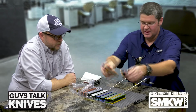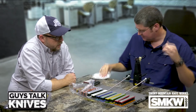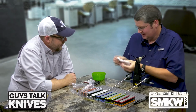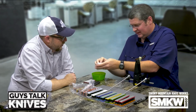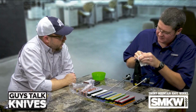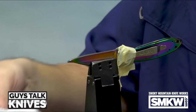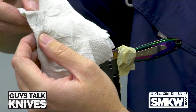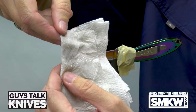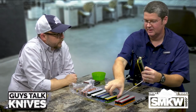And we're good. Now, one thing I'll do, usually, especially once we get down towards the finer end, I'll use high quality H2O. Just a paper towel. Get it a little bit wet. You don't want it super wet. But what you're doing is wiping off the abrasive and the dust. Hold it right up next to the blade, and I can start seeing the metal shavings plus the abrasive coming off. As I progress through the different abrasives, that should get smaller and smaller and smaller.